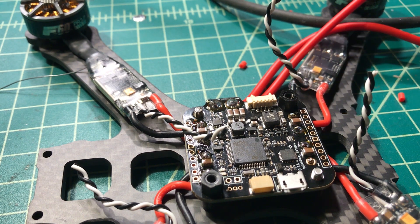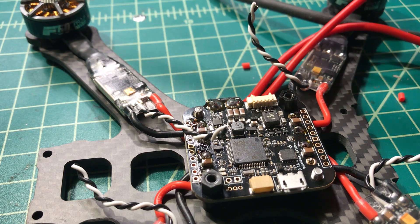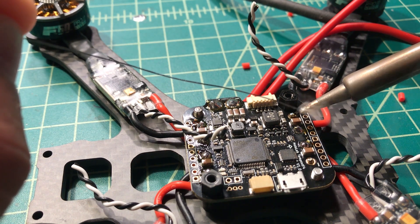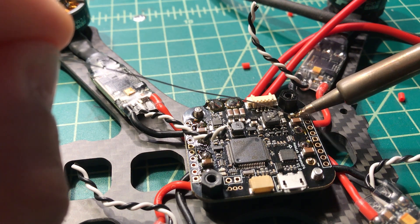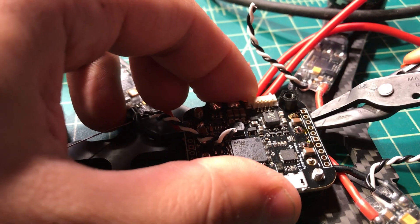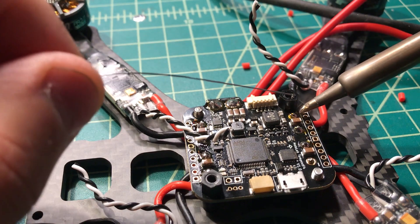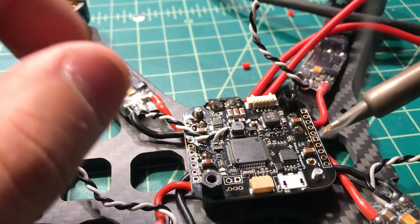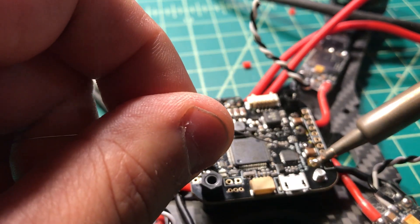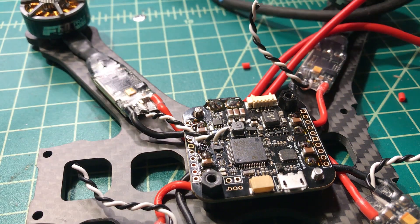I'll add more flux. As you can see it's kind of tight quarters, but there's enough room to run that big tip, so that's what I'm going to do. Broad tip — I like to keep it clean. Get the tip wet without touching any other components. That one moved a little so we're going to shove it back in. Work kind of fast — you don't want to keep the iron on there too long. That's one, and there's the other one. It's a little bit longer than I'd like to keep it on, but it should be fine.